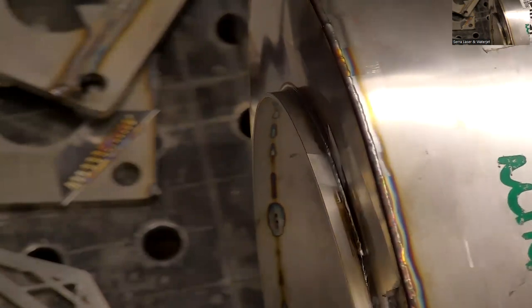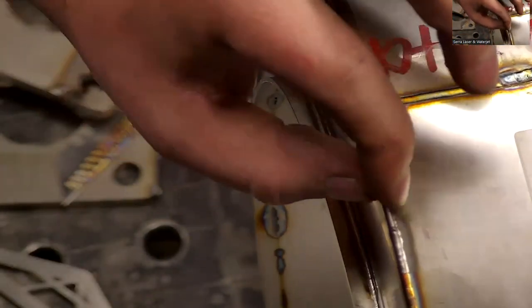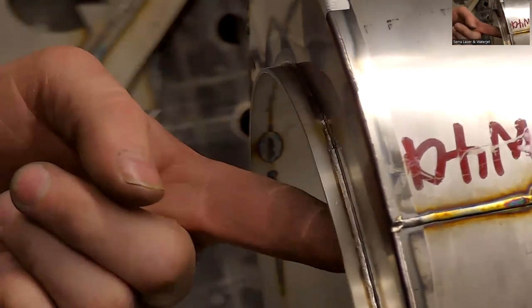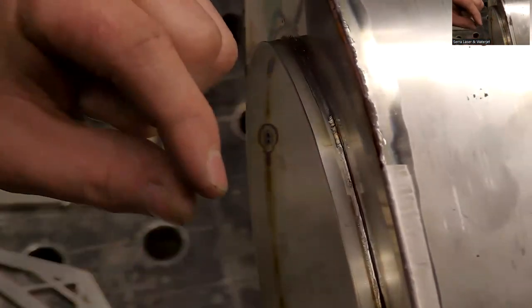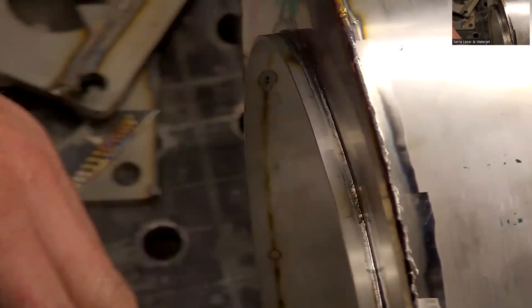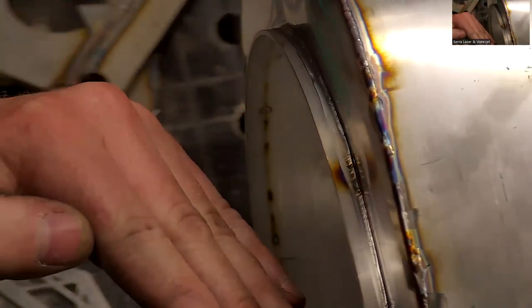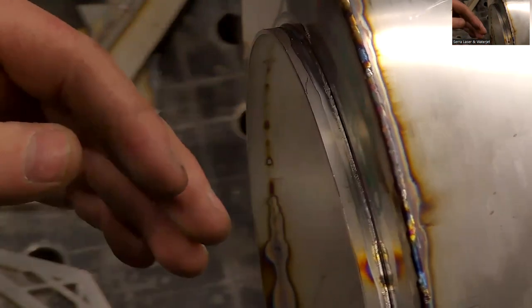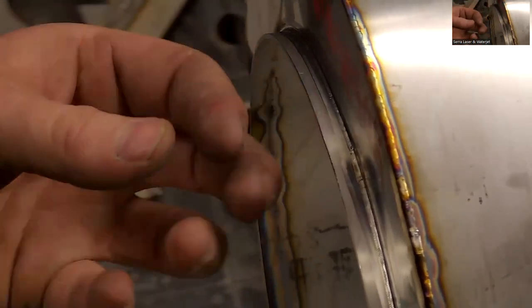With this material, you can do this with any of them, but with these fine corners, say you wanted to weld this and have less chance of going through back here, you're going to have more control with the XR. Essentially, because it has that higher energy density, it lowers the minimum energy threshold necessary just to melt the metal. So the XC and the base model have trouble melting the metal at really low power, but the XR does a good job with it. Makes sense. Okay.